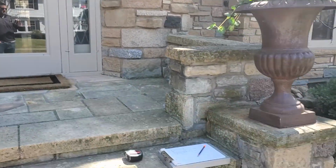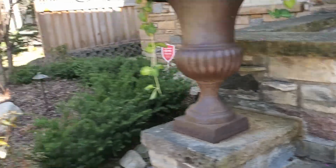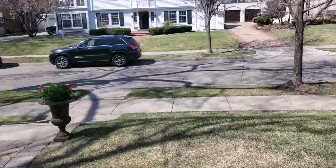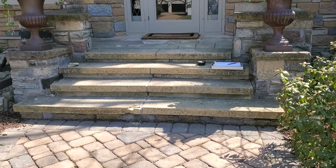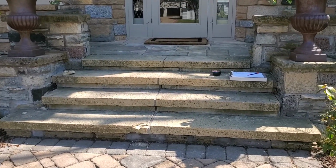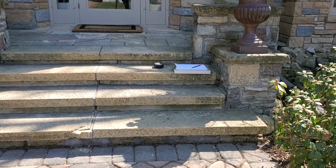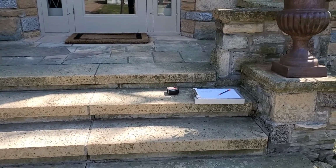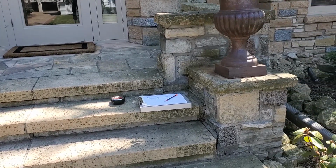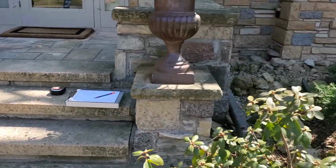We're going to need to either find some pieces, or we're going to have to salvage some pieces that we have here. So the dimensions on this is 12 feet wide, the landing is 6 feet deep, and the treads are 14 inches deep. Now I've taken measurements of the individual parts and wrote them down. So I'm also going to ask Sherry to help me do a SketchUp of this one, and so some of this stuff is for Sherry.